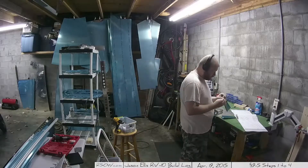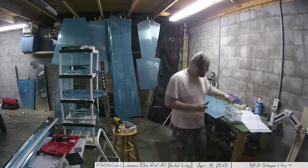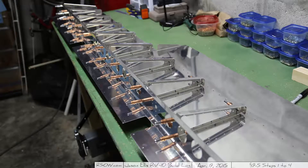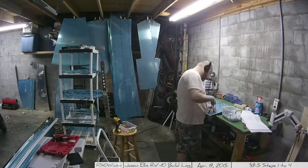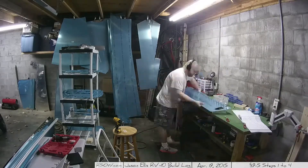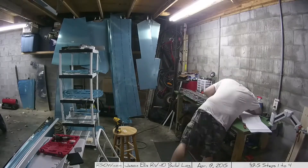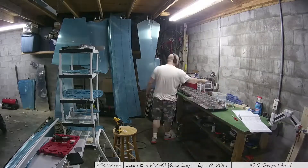This is the beginning of section 9-5. Here I'm going through and taking all of those ribs that I previously created and I'm clecoing them to the front spar, then clecoing through the skin to the rib itself so they're all solid. You can see each of the ribs in their correct positions. Inboard and outboard facing is important, so make sure you follow the instructions there. Once that's done, I go forward and put the rear spar in place and cleco it down. None of this is overly complicated - just follow the instructions and pay attention. It took me a little while to find the 9-05 root rib; I had it hidden underneath some other parts. Having your pieces organized is probably better in the long run.